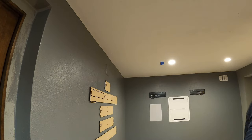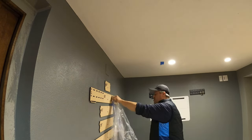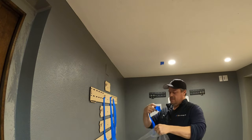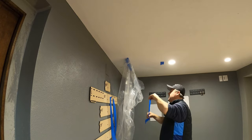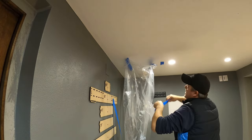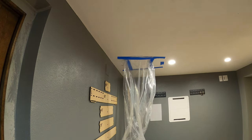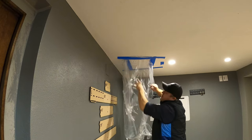The real goal here is to use blue tape to your advantage. I've got my bag — I'm going to pull off four chunks of tape and show you why we do this: it keeps dust down. On a lot of jobs we do, a retrofit can't have dust in a new hole. So I'll take the tape and literally turn it into a little box around the cut area — going right here, across here, across here, and back. Double-check it's snug; if it's a little loose, add more tape. Now it's clear and I can see my opening.